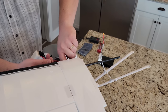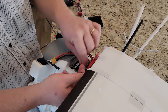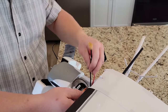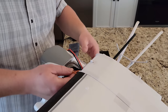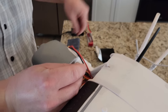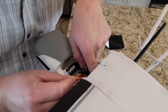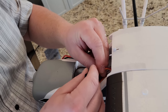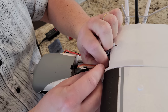These are antennas — I was trying to show the people what that was. Those are antenna ends from this FlySky receiver. And then this is a power cord that goes to your battery. And then these are the three wires that go to the flaps and aileron. So what I'm going to do real quick — this is aileron. Why are there three aileron plugs? That is so weird. Oh, you know why? Because that's where we're going to plug our power for our LEDs.